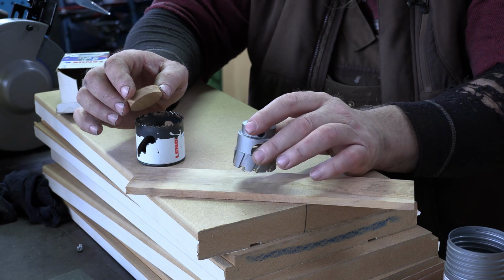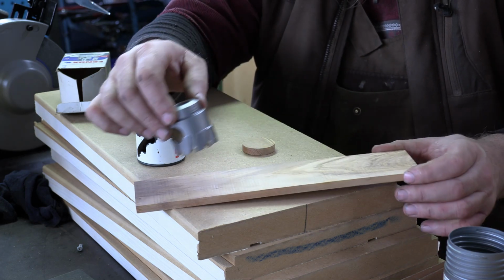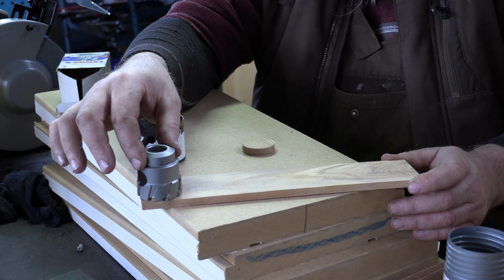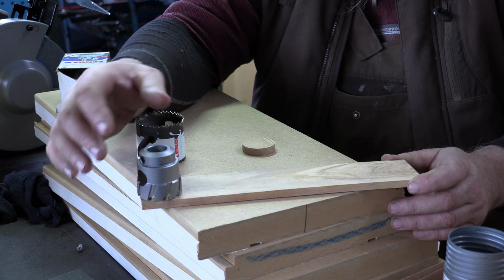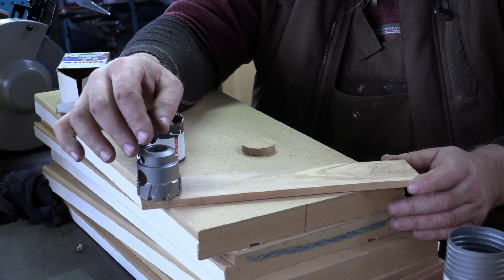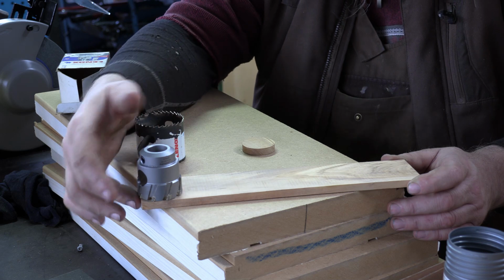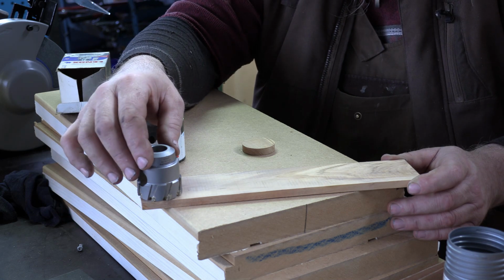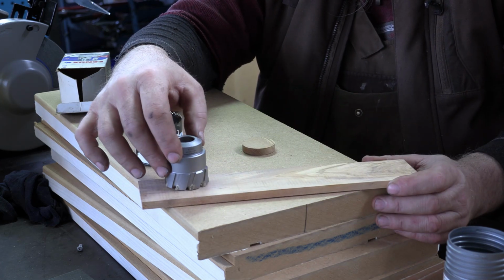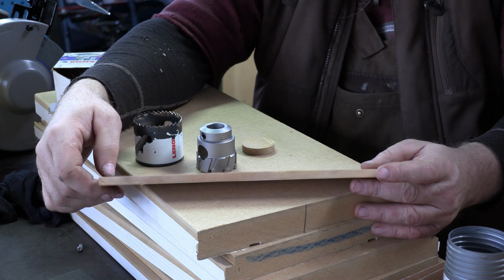That, of course, again, is the dilemma of the material at hand. It's not a width to where it's optimized for the tool. So we're going to end up taking one cut. We're going to run it to the maximum allowable edge where we're still in the material, going right to the edge of the usable material, and essentially ejecting the chips out the side, but still creating a round to where we're not totally outside the edged part of the board. And then we're going to stagger it back and forth and try to optimize the recovery of the material.